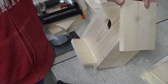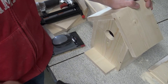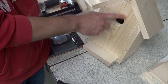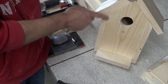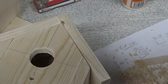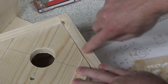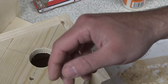So this is what we came up with — all done, everything brad nailed. If I were to use a little bit of wood glue there, you wouldn't see those hairline cracks. You could barely even see that on camera, but if I were to use wood glue, it would have tightened that up and made it more seamless. Before we go ahead and put the primer on, I have a little tip that I picked up from an old man a while ago.